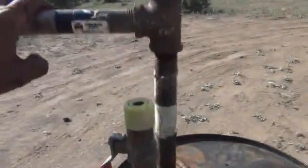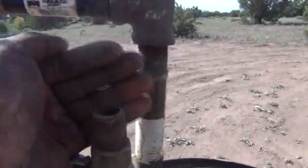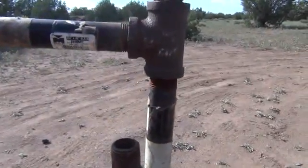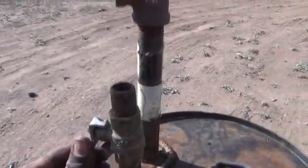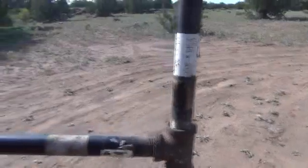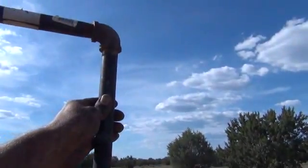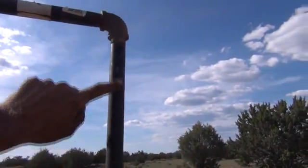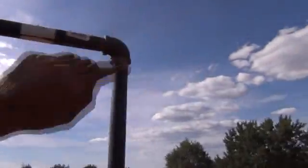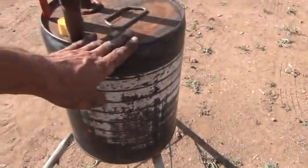The gas is going to roll down here, and you can tell there's a little bit of gas starting to roll out. With the wind here it's a little difficult to tell, but there's some gas starting to roll out right there out of the top. All I have to do is shut this valve when I'm ready, and the gas is going to start working its way through the system much more effectively. As this gas starts to cool, it's going to come up here and work its way uphill. As it does so, the hydrogen inside of the gas will be the lightest of all the gases traveling uphill and definitely make it over the top. Much of the creosote will re-drip down into the second collection container here.